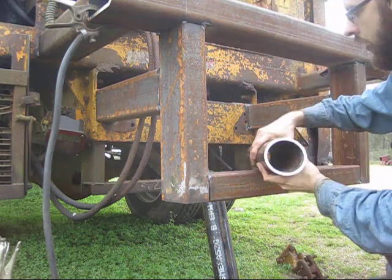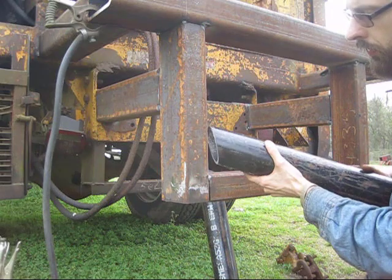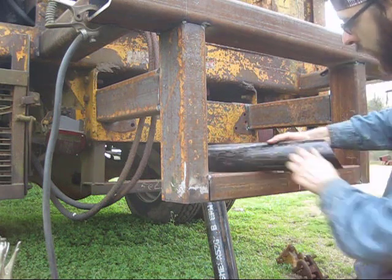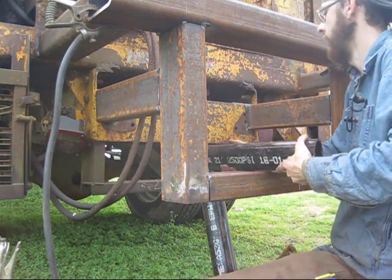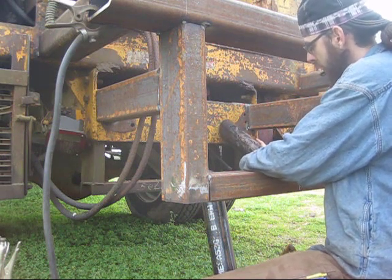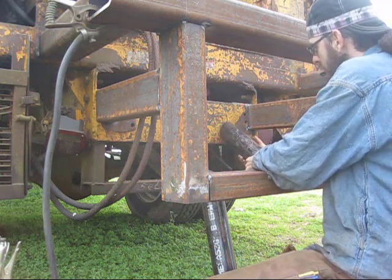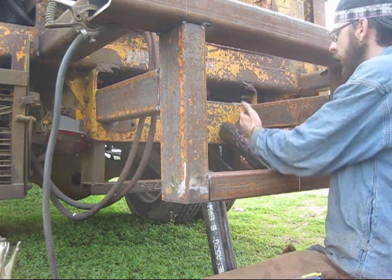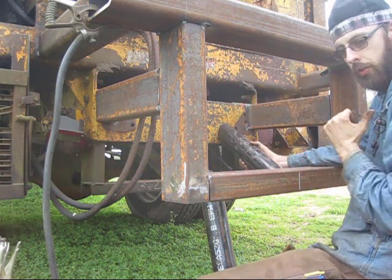So what I've done is I've taken two pieces of 3-inch here and I've cut a miter on them. I don't know if you can see that real well. How about like that? So I've cut a miter and I've done it on both ends in the same direction, the same plane. So this is a 30 degree cut, same thing on the other side, it's just parallel. It's almost like a trapezoid and a round pipe. The cool thing about doing this, as long as you've got two parallel flats, is that you can twist them a fair amount and get an angle brace coming off of here, and it won't be just straight up and back. It'll actually have some triangular bracing in it, more or less. It's kind of like how roll cages and stuff are built. It'll be very, very strong in pressure, or not really pressure, but in tension this way and pulling from this direction as well.